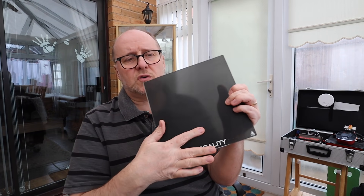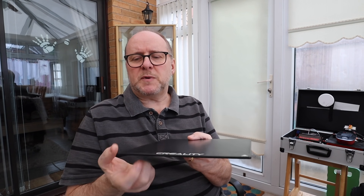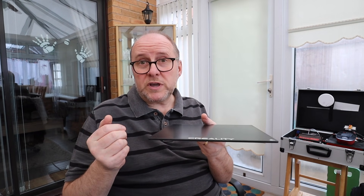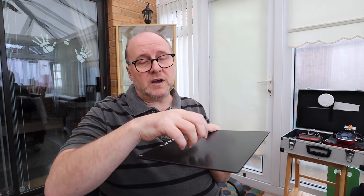Instead of that magnetic plate I bought a same-size glass bed. Plain glass on one side, and this side has got a textured finish — the same sort of material as the plastic sheet, making it a little bit more tacky. Because it's glass, the whole surface heats up to an even temperature, whereas the plastic is probably hotter where the elements are. Glass absorbs and holds heat — there's a lot of thermal mass — whereas the plastic cools down really quickly when the heater goes off. So it could be a little bit more economical energy-wise. Once you've set the bed level, this doesn't warp or twist. I like this upgrade. That was £12 — not expensive.